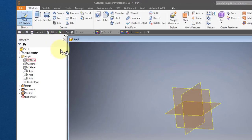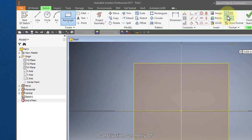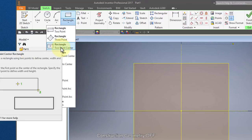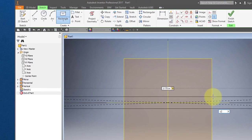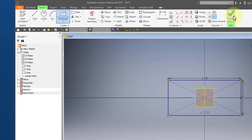I'm going to create a new sketch on the vertical plane. Turn on construction and I'm going to project these two lines, these two work planes, to create lines on the axis. Turn off construction. Select two-point center rectangle, select the origin, enter 3.17, tab, 1.53, tab, enter. Finish your sketch.